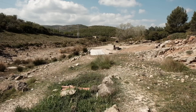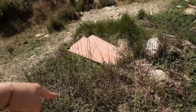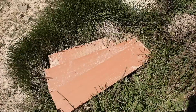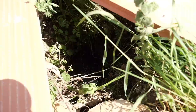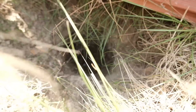The reason we think this is, is that part of the pipe that brings the water goes underground and is probably getting blocked and clogged up with mud and silt. There's actually a weird thing going on with that underground section which I couldn't figure out for ages. Today we're going to try and clear it out. There is an underground pipe that comes from the end of that spring just there and it comes underground along here. Just beyond those trees it comes out of the ground and flows into one of our first deposits. All along the path where this underground pipe goes, there are little sections where the ground has been dug away, boards laid over the top, and down at the bottom the pipe is exposed and broken — so you've got water seeping out and silt getting in.